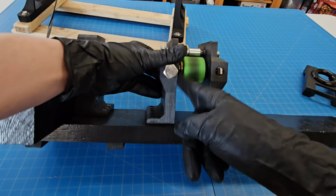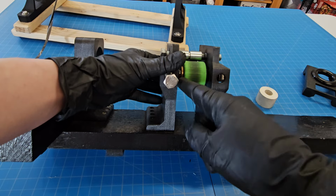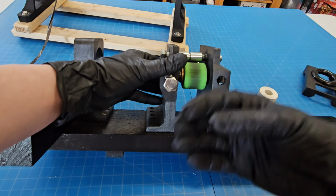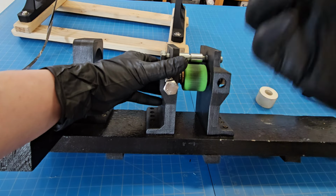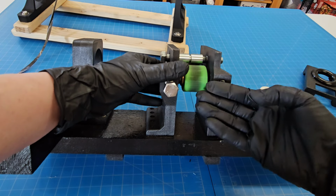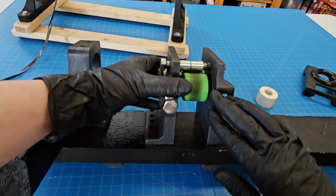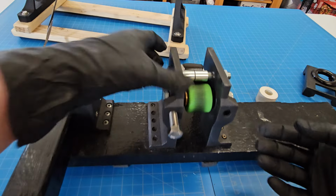And I used the same piece that goes in the center there for it at that time. So I sized the hole to fit with those existing parts, and then I just played around with the diameter, the placement, the layer height, the infill, until I found what worked with this. It has to have just the right amount of firmness and texture in order to properly pull the carbon fiber through. All of these things have to work together.